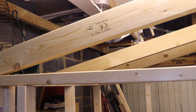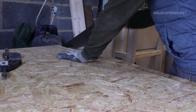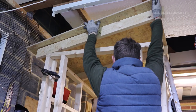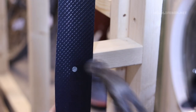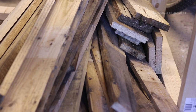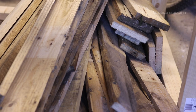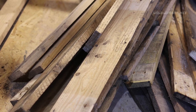I decided to do this in my garage so that I wasn't restricted by the elements outside. I then cut the roof using more OSB timber and screwed it down. Next I put more DPC on the outside structure of the bird hide. You'll then need to disassemble all those pallets that you've collected — you can watch my how-to-build-a-compost-bin video out of old pallets for tips on how to get them apart.